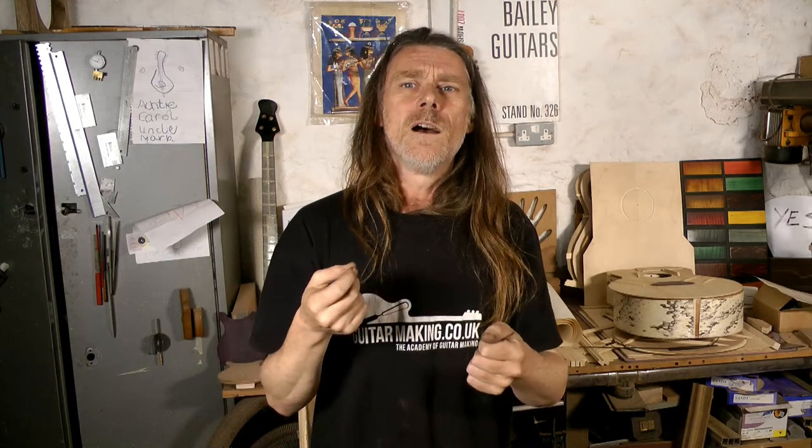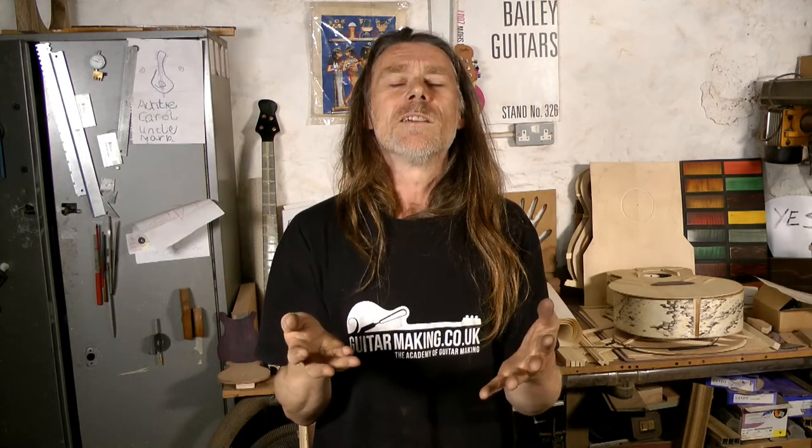But I don't know if this is true for all guitar makers, but most guitar makers don't want you to touch the truss rod. Don't touch the truss rod. You shouldn't need to. Once it's set, provided it's settled down into its environment, you might need to do an initial setup. But you shouldn't really ever have to touch the truss rod unless you change the gauge of strings, or unless it goes to a new environment, like a really dry environment, it might settle, or a really wet environment that's different to the one it was made in.